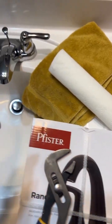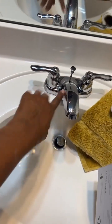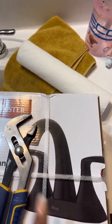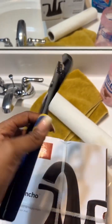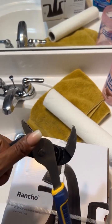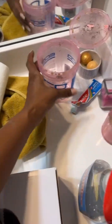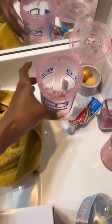Make sure you check the base style. This one has a little base at the bottom, which is what mine is already cut for, so I went with the same thing. Yours might have spaces in between — those are called widespread — so make sure you buy the right type. You'll also need vice grips or an adjustable wrench that opens up wide, cleaning supplies like Windex and towels, and something to catch the water.